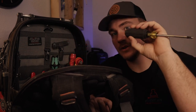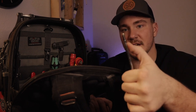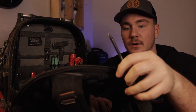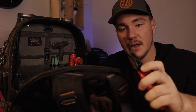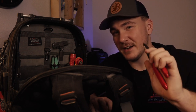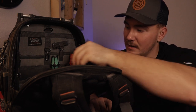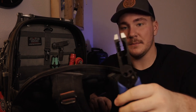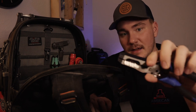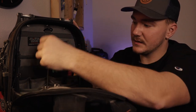I have one standard Phillips driver — probably just because it doesn't have the insulation around it, so anytime I need something to fit in somewhere tight I'll use that. Next these are Weha strippers for romex — I just haven't gotten them out of here yet since I got another pair to replace these. Those are the Ideal ones — they actually have a lineman head but also do romex 12/2 and 14/2. Especially for panels, you want it to look as clean as possible, and this is the cleanest way to strip the sheathing off the romex.